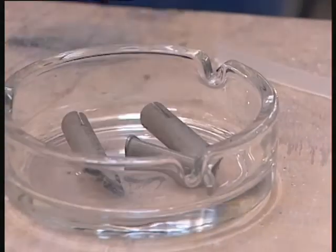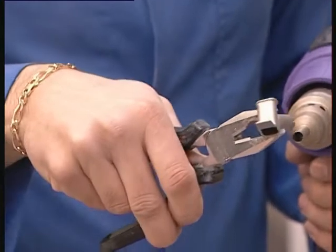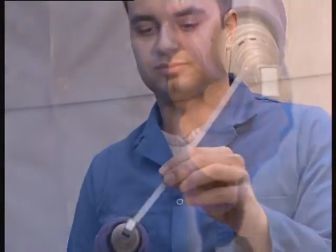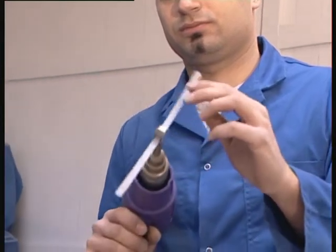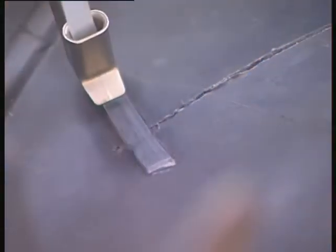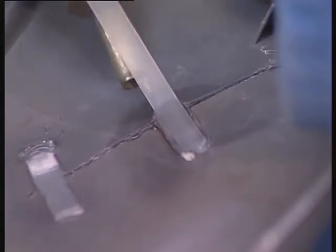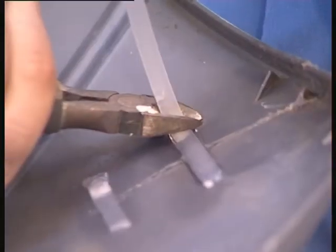Remove the welding nozzle and apply the backing nozzle for flat bead sticks. Use the bead stick that corresponds to the type of plastic. Apply two or three backings inside perpendicular to the break. One of the backings must be applied to the edge of the area.